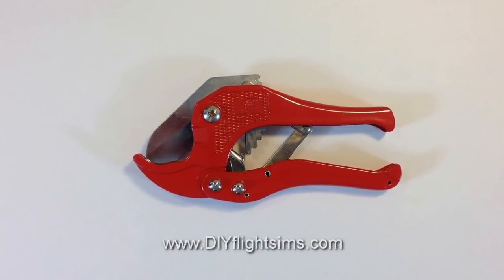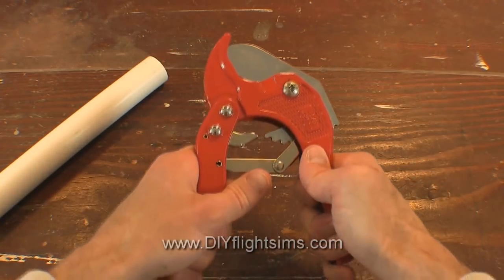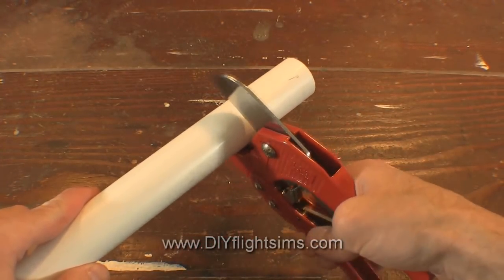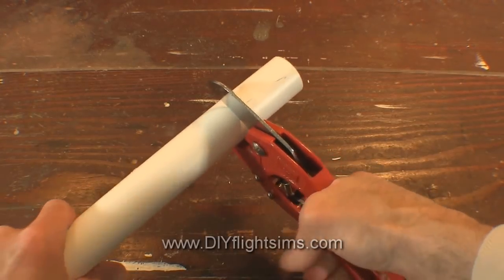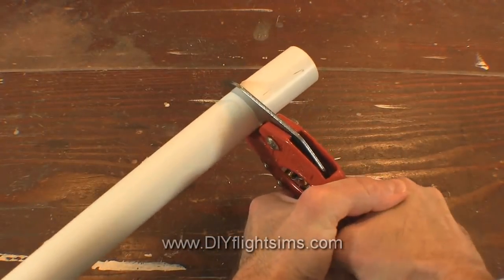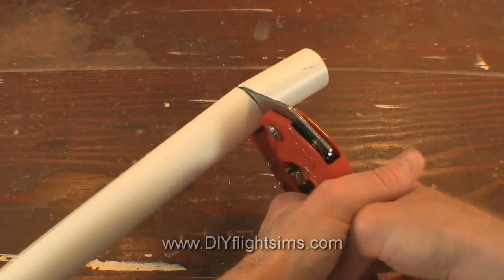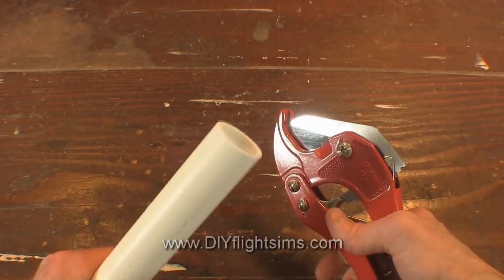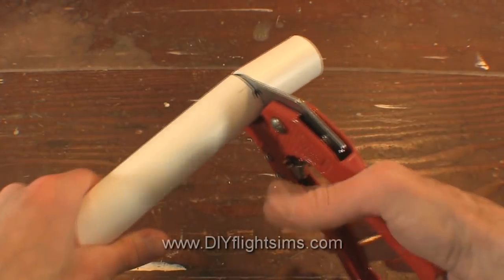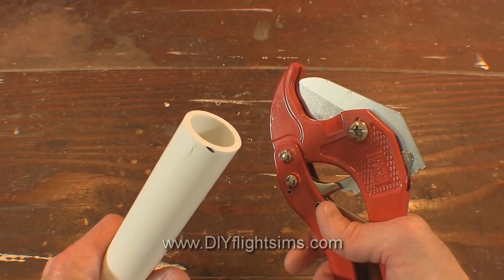There are a few different ways to cut PVC pipe. This is a PVC pipe cutter — it has a strong ratchet that forces a thick steel blade to cut through the pipe. Position the blade right on your mark and squeeze and squeeze. It's actually kind of fun to cut through pipe like scissors. The pipe cutter is pretty awesome — it only costs about $25 or $30. It's small, portable, and quiet. And look how cleanly it cuts.